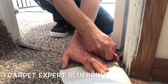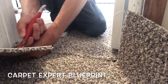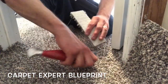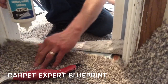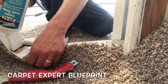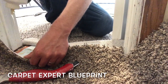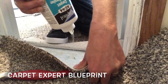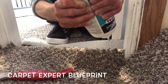Now that the seam's cut, everything's ready to go. I'm rough trimming everything down in this tiny closet — the camera's sitting on a tripod in there. I'm going to fold this back — watch this hack move. Seam sealer adhesive. I'm not even going to hot burn this. I'm just going to drizzle that seam sealer down in between the seams there. Slowly dripping out — look at that molasses coming out. I'm going to zigzag the glue back and forth, get it down on the padding, and once I get to the other side, literally just going to drop it down in there. This closet is a little one and a half by one and a half, so it doesn't matter too much. Just going to go ahead and glue the seam, drop it down, seal it, and then trim it in.